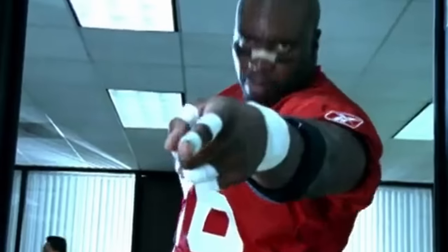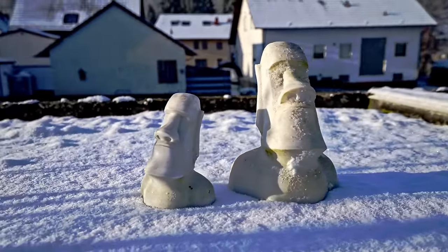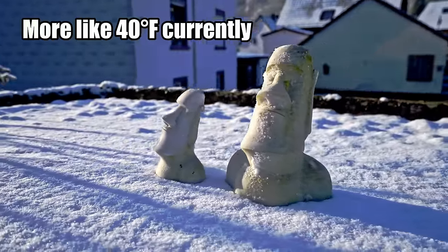You don't even need a heated bed to print it, although it's advisable to use one. That also means PLA parts can't stand much heat after they're printed. Direct sunlight doesn't seem to be a big issue as long as it's outside where air can move — I've had these two Moai outside for years now with no issues. But outside temperatures don't go above 40 degrees here, so your results may vary. I've had parts melt in the office under direct sunlight, and cars are even worse — with no air movement at all, PLA doesn't stand a chance against the heat.